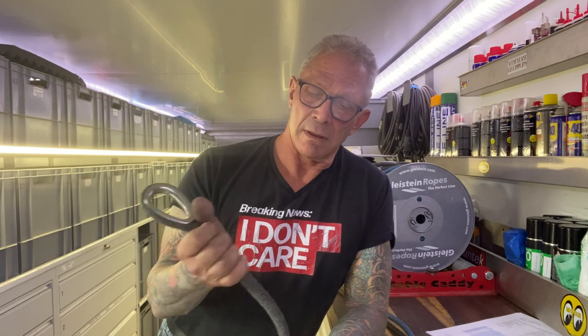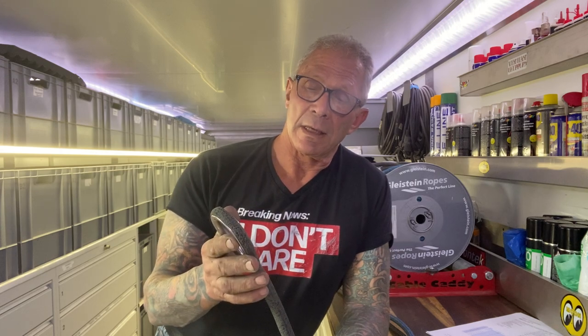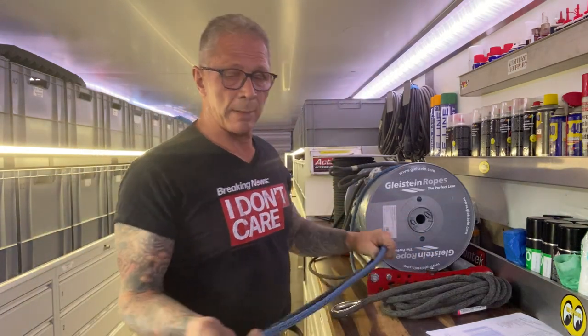These are transitional ropes to use for the ratchets and other devices on the ground at your base station that terminate to your flying area. Because of the strength of the rope, this one has a very large shackle on it — which is the correct size — or a very large thimble on it, which is the correct size for this rope. I use a shackle here always; I don't use a carabiner. With the rope at this strength, why would you bother? Carabiners at most are three tons, some are five tons. You can get a five ton shackle that's small and put it on there and it works quite well.